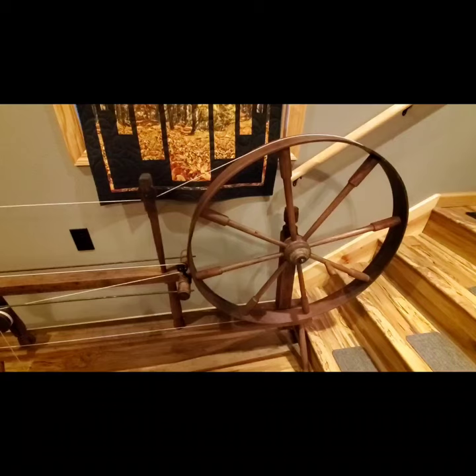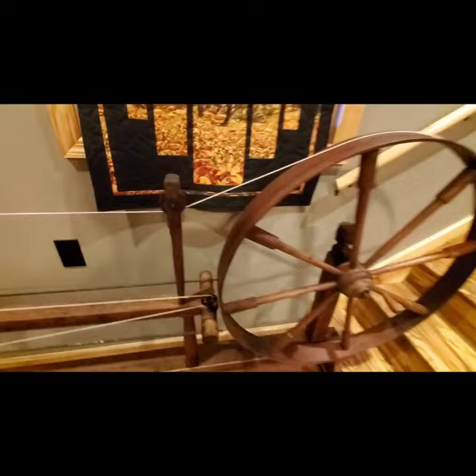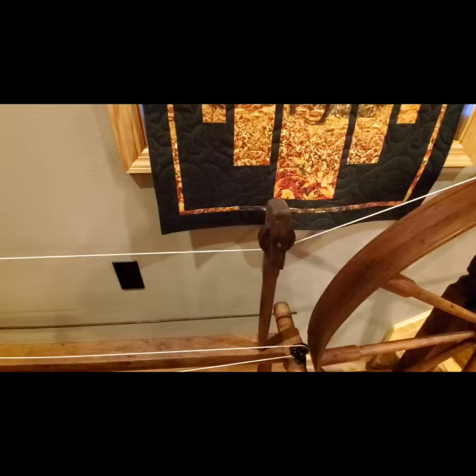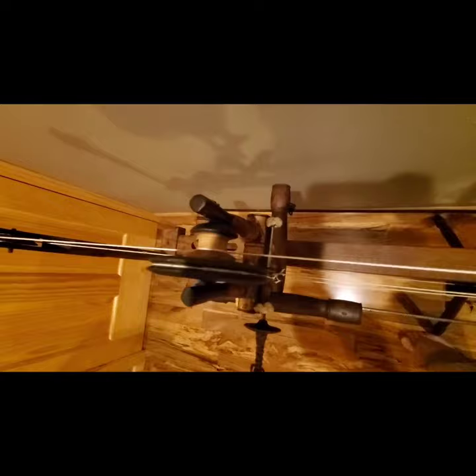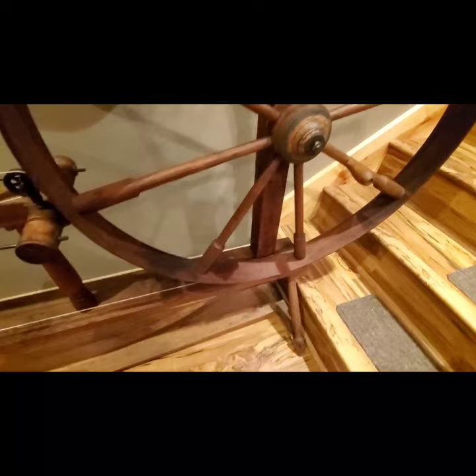To begin with, there's actually three bands on the wheel. The drive band, as you can see, goes around the main drive wheel. It comes through this pulley — this idler — which drops the band down in line with the head and gives it a little more wrap on the wheel. Then the band moves to the accelerator head, where it double wraps, on around another idler pulley, and then on down to the frame of the wheel, back again to the wheel itself.